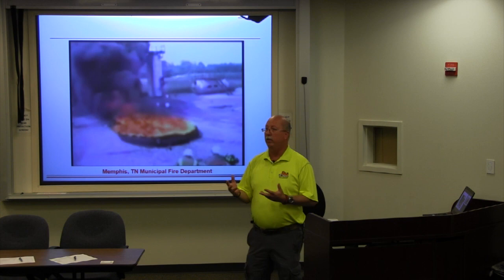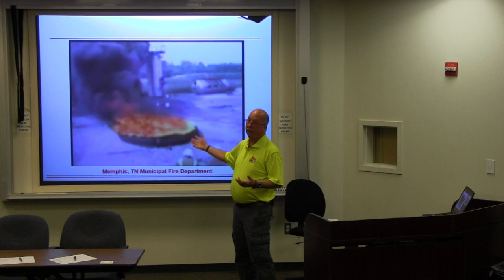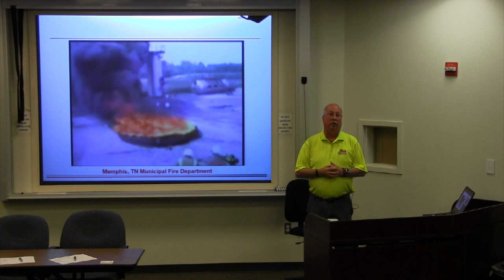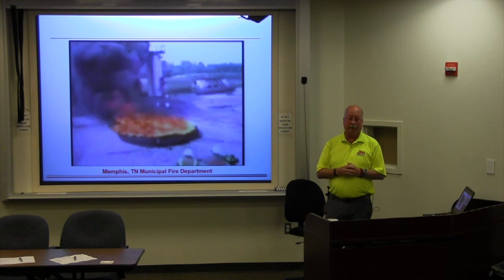As you're aware, with foam there are only three application techniques that can be used. You either rain it in, roll it on, or bank it. Well, if you've got an open pit and you're trying to rain it in, as we talked about earlier, foams are just a thin wall bubble. As you start raining it down, the heat is just going to evaporate those bubbles away. So it's going to take a lot to cool it before that foam can start to extinguish, before it starts attacking it. Because you have small sides, this would be one where you could roll it on, but you're not going to bank it in because there's nothing to bank it with.